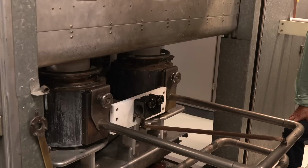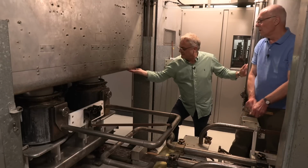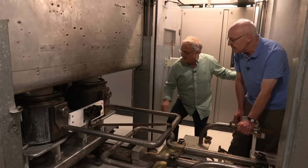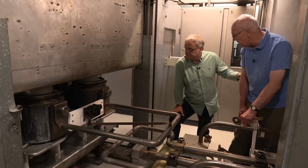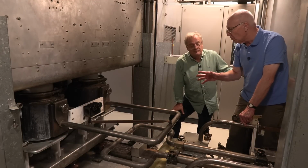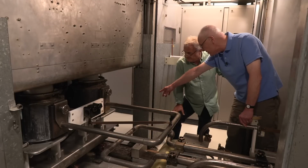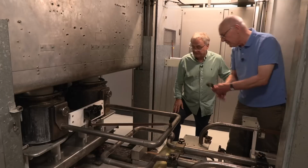Plus modulation. Oh yeah. I couldn't help noticing here, Dave, that everything is rounded edges. So this metalwork here is rounded edge. Your coil here, all very round. This here, with the bolt head in the middle, that's all round. Here, all rounded. What's the reason for that? Because of the high voltage, you get a 44 kV peak in here at 100% modulation. Whoa. That's 4 times supply. So you do not want coronas or flashovers to the earthy outer. Notice the tubes are standing on an insulated base as well, and that's got the rounded edges just the same. In fact, you'll see the worst place is often on that head there, and that's why we use this.